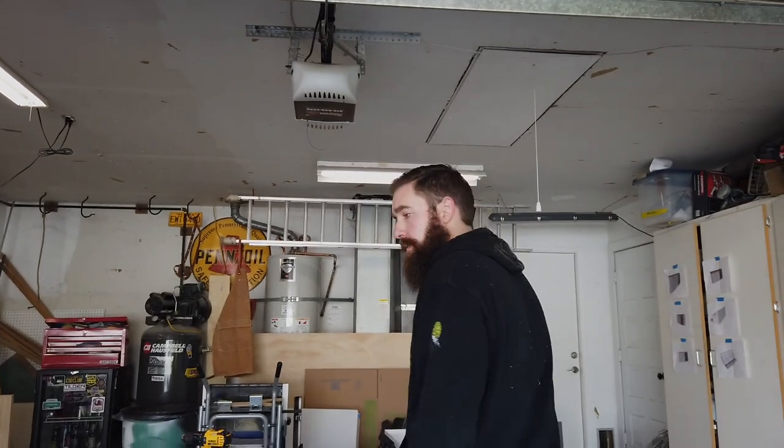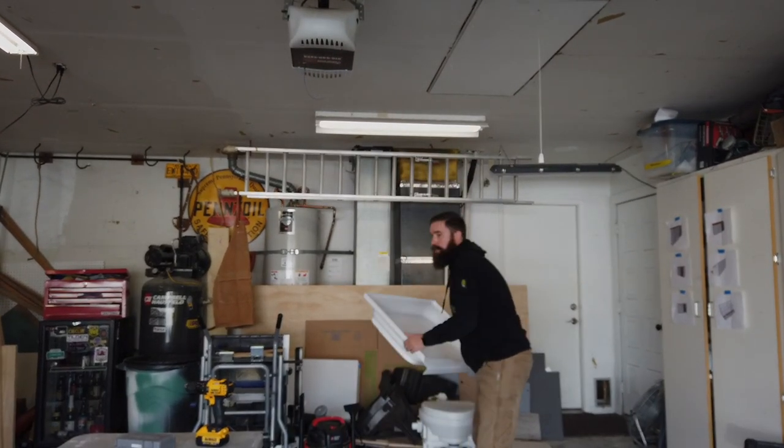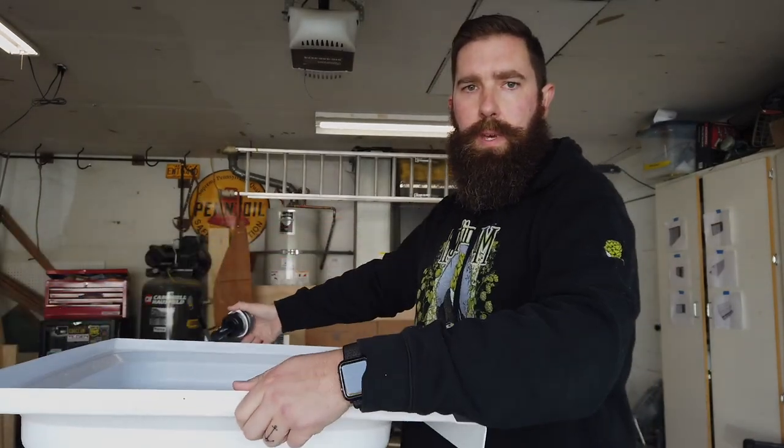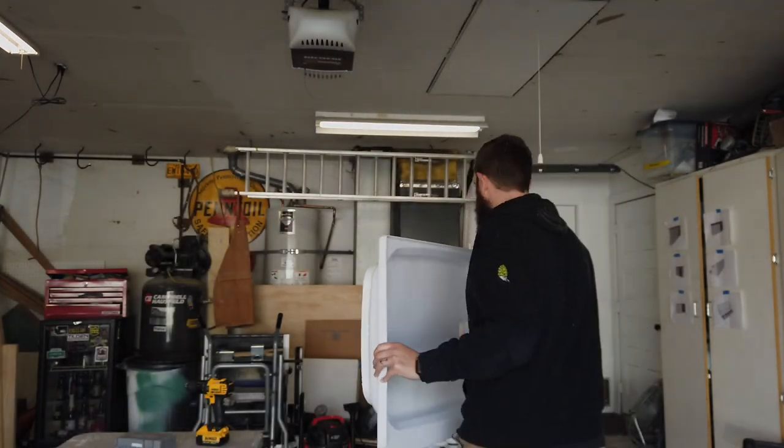Okay, so I'm going to build the base for the shower pan. It's just going to be a very basic square frame for this piece to be sitting on. You can see the flat piece down there, kind of bevel along the edge. This will be sitting right into the base. It's got foam on the bottom, which I'll glue to the bottom of the actual subfloor, and that will hold the shower pan. Things we'll need for this project: